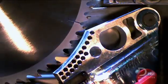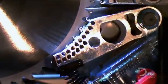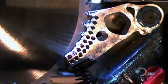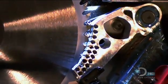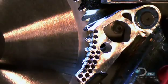5,000 RPMs is a lot of energy. The energy has to go somewhere when it stops, so it's transferred to the saw stop module, which acts like the crumple zone in a car. The module and saw blade are now officially trashed. But hey, at a cost of about $60, better to pay that than with a finger. It's an amazing idea, and it's implemented in a way where you're using energy for its own stop.